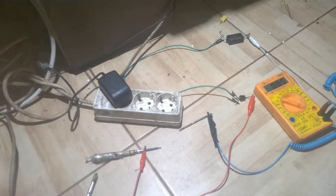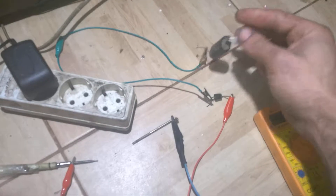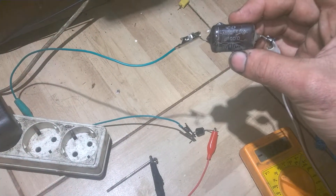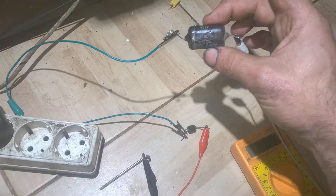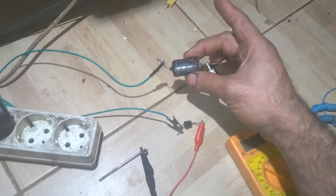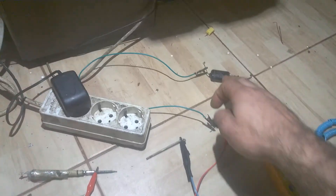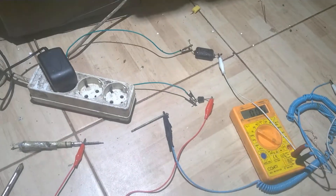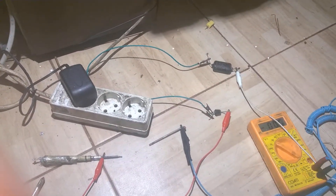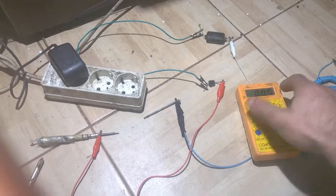On the floor we have a big mess. What we have here is a WIMA capacitor rated at 1000 volts, 0.005 microfarad. I know this capacitor is bad — I haven't tested it yet — but these WIMA brown capacitors are always bad. It's a 1000-volt capacitor and we're going to test it at a hundred-and-something volts. You might say that's too low, but if this capacitor is leaky it will still leak at that voltage.